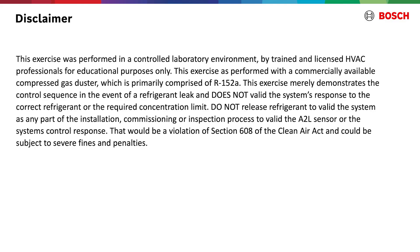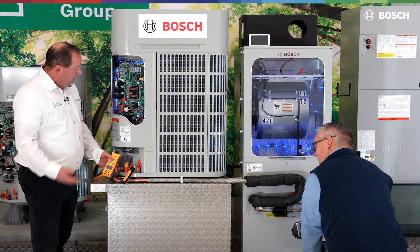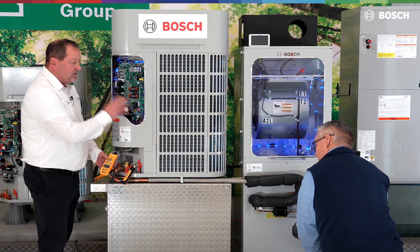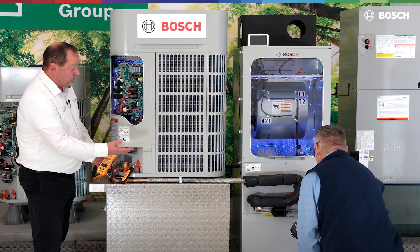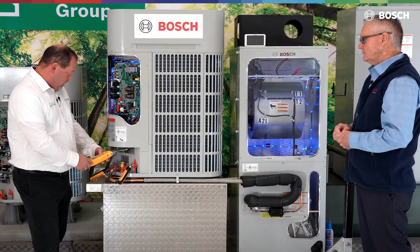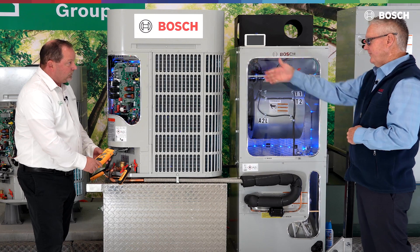As Fred said, it's going to shut the compressor off, and the other part of that is it's going to turn the fan to high fan speed if it currently is not already there. We're going to be looking at our amp meter here too. I'm looking at compressor speed right now, which is reading 31 hertz. When that compressor shuts off I should be able to see my amp draw drop and my digital display go back to the T4 setting — which it has. Fred, I think that took what — 10 seconds or less? I don't know how much you squirted on that thing, but 10 seconds — the compressor shut off. I do believe I heard the fan motor kick up a gear to high fan speed.